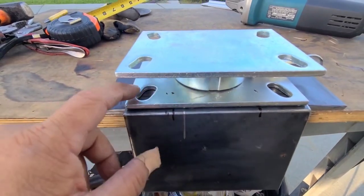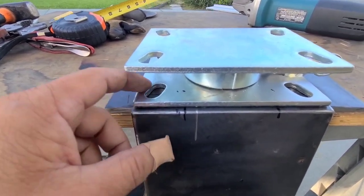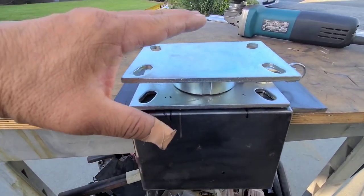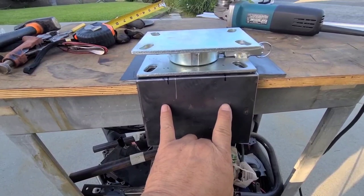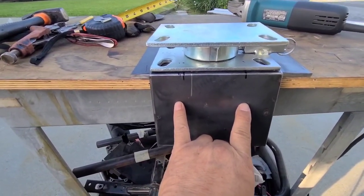The reason I want to do that is because I don't want to use these holes — these are way too big. I don't need to run an M12 or M14, I just want to run an M10 to mount this turntable into this bracket. Then I'm going to drill two holes here, but it's going to take some measurement — that's going to bolt onto my Versatrac.